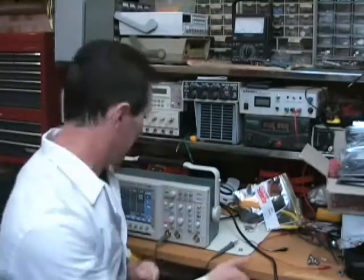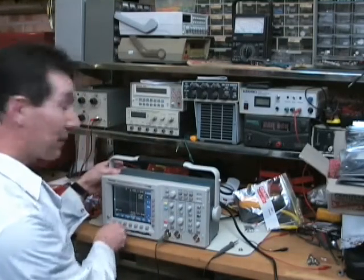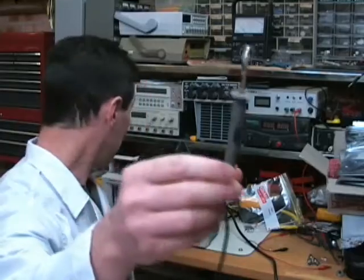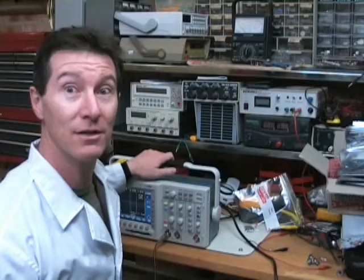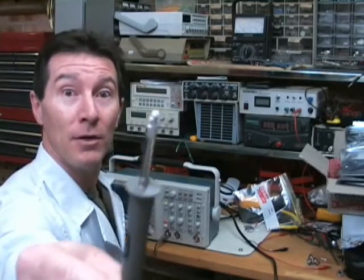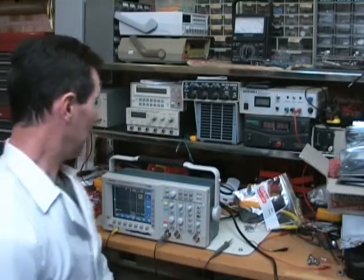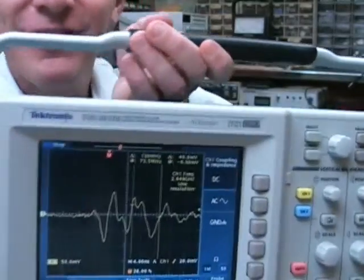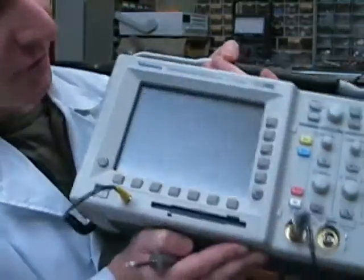And I know what you're thinking again. The oscilloscope actually has a grounding terminal on the front. I'm going to plug the wrist strap into the oscilloscope grounding terminal. And I'm using a proper Tektronix probe, a 300 megahertz Tektronix oscilloscope — pretty good one. I've got a nice alfoil short on the end of the probe. Single shot. And bingo — complete with anti-static coat and wrist strap. Check it out. You still don't believe this thing's an issue? That's 50 millivolts per division. Told ya.